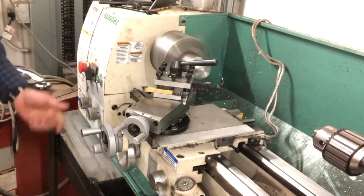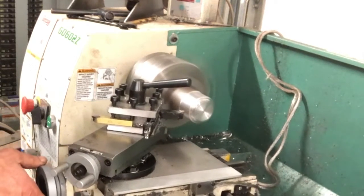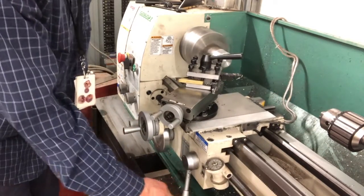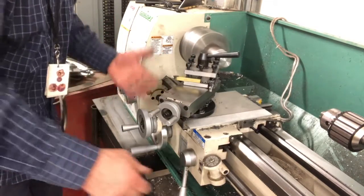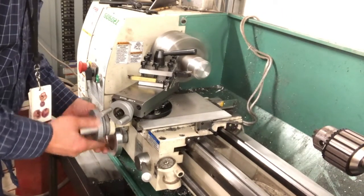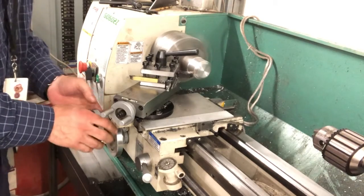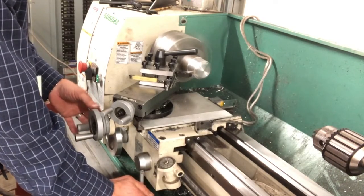We're going to turn it on. Now I can cut this manually, I can do it by hand. But what I can do is use my lead screw. Watch as I push down on this half nut lever and the whole carriage then turns — it moves the whole carriage for me. So I can unlock it, find out where I'm cutting. I just started to make it cut. I can turn it in maybe two thousandths or whatever and then lock that down and it does the cutting for me.